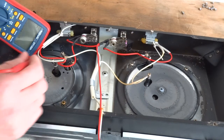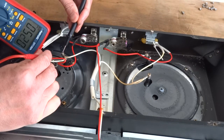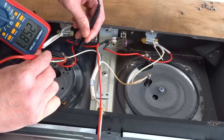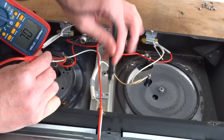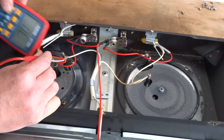Got my meter on. So 52 ohms, no short circuits, with a little bit of current to earth — but it's in the mega ohms, so it should be alright.